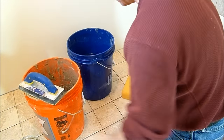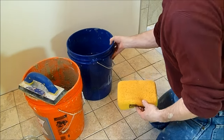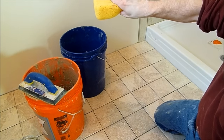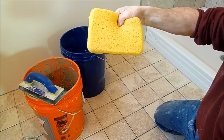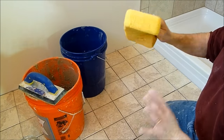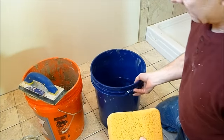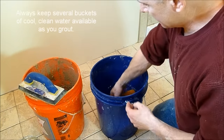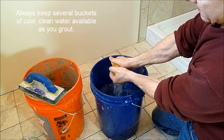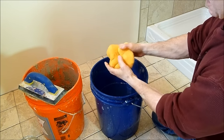When you're wiping with the sponge, that's really the key to this whole process. What you want to do is, as you're wiping, you're also turning the sponge. You're going to get one swipe, turn the sponge over, get another swipe, and that's it. When you rinse out your sponge, rinse it out as best you can — get that whole thing in your hand and squeeze all the water out. There shouldn't be any water left.